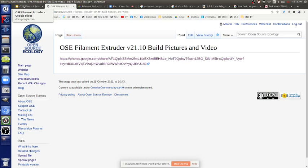But if you want that to affect the heating... I thought the thing that displays the LED of the temperature was also measuring it. Yeah, you're saying it is. So there are four thermometers: two from the two separate controllers and two from the RepRap. But only the separate controllers are connected to the SSR, the solid state relays. So only the separate external controllers are actually affecting the wattage that comes into the heating.